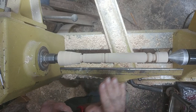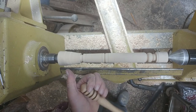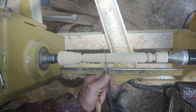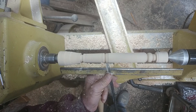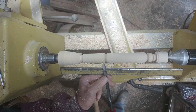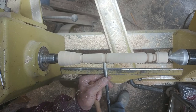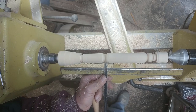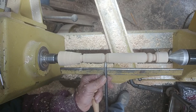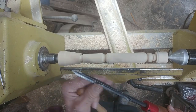I'm going to bypass the handle part here and come back to it. The next part I want to take this section right here — I've got my low spot. This is more of like a tulip bulb shape. I come over here, pick up my shape, and I want to kind of round this bulb out, just like that. I come over here on the right below the barrel and do the same thing. I'm doing this all with a detailed spindle gouge.